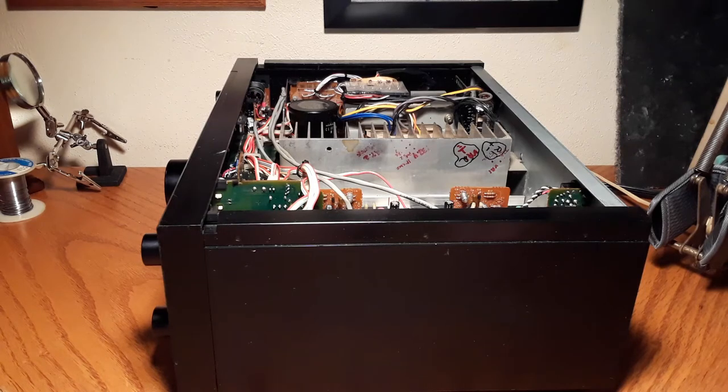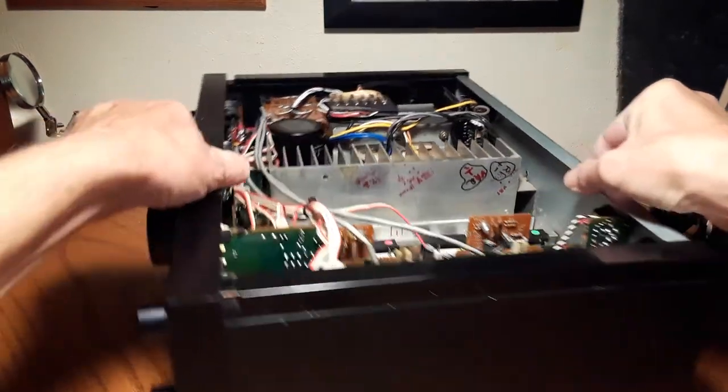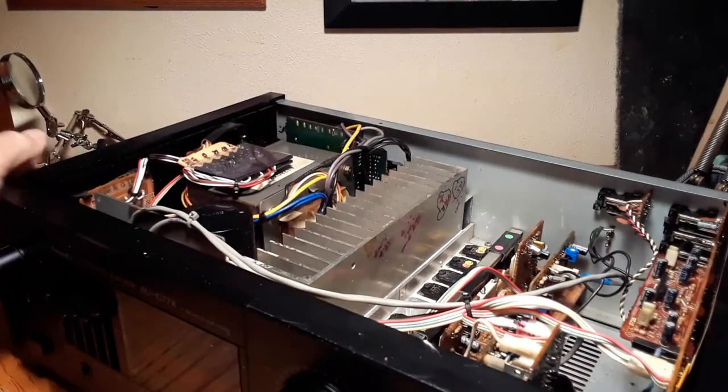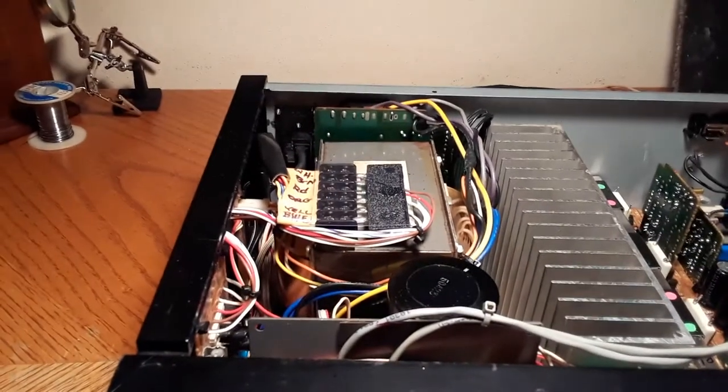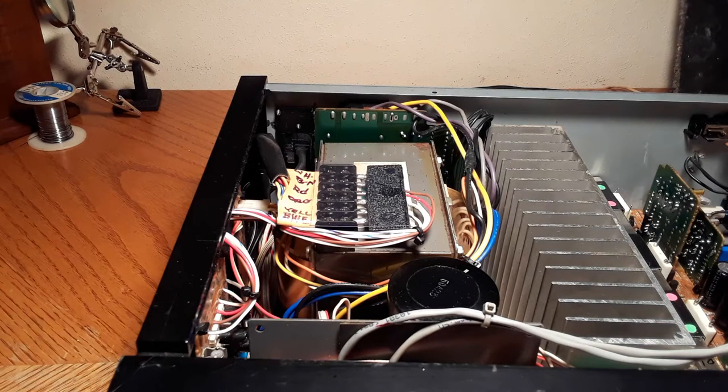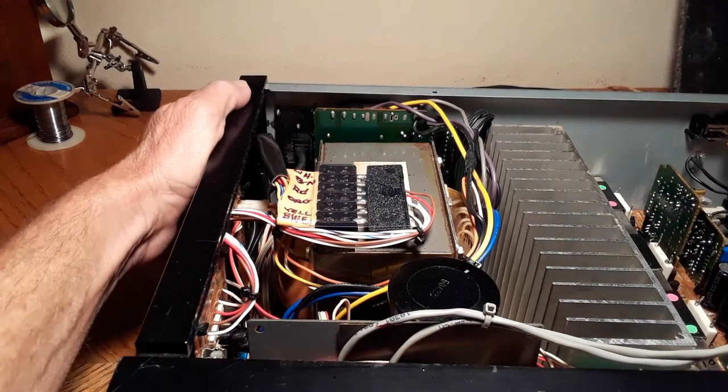But the electronics that are in this box just don't facilitate that much time and effort to even modify the chassis at best. So with that in mind, you've got a 30-pound transformer sitting in a plastic box. Anytime you need to work on this, at least a large percentage of the time, you're going to have to pull that transformer out — and that's going to be a headache. Let me show you what I did to try to alleviate some of that problem.